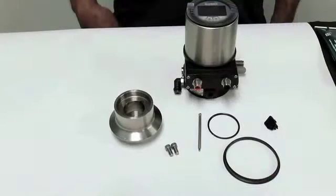The components needed to complete installation of the Burkert positioner are shown here. These parts are used on a fully maintainable actuator. Adapter kits are available for maintenance-free actuators as well. Electropneumatic positioners can be easily retrofitted onto existing valves, especially to upgrade from fully pneumatic positioners.